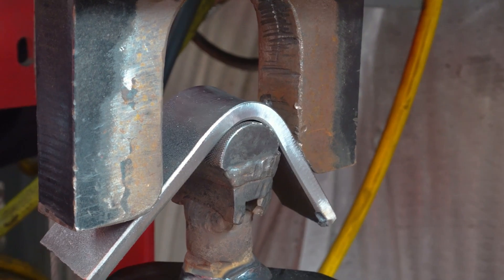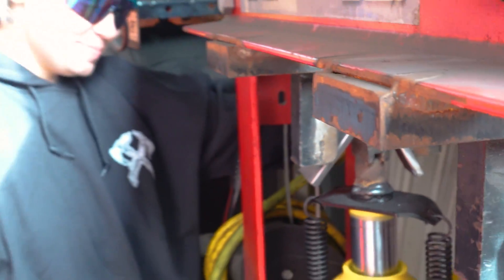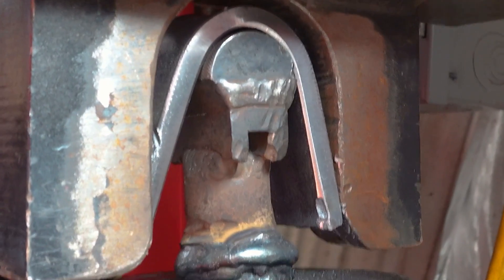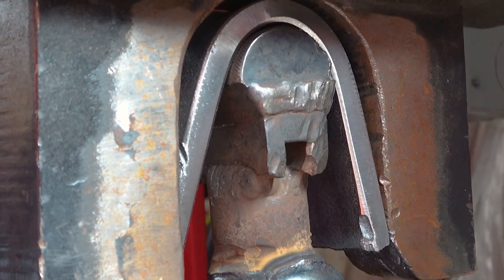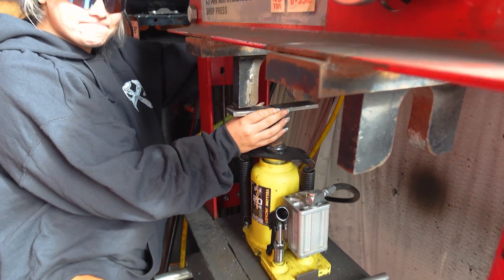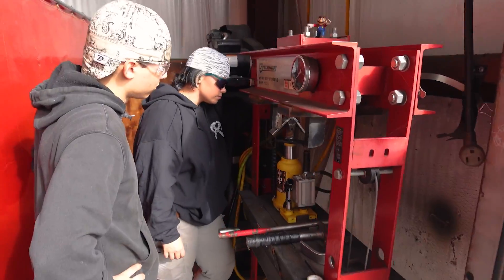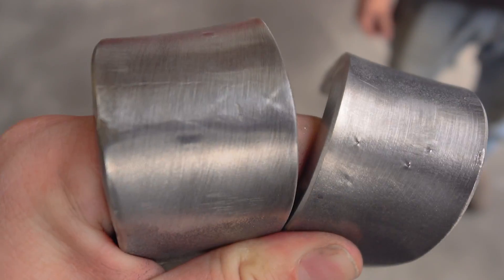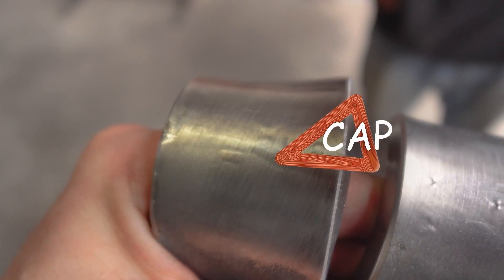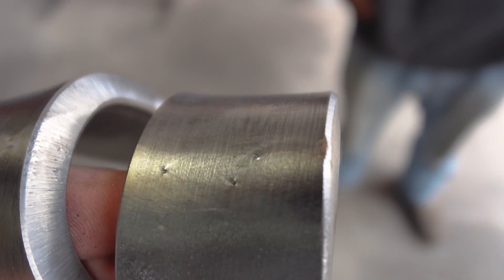The slowest bender ever — we've got to do four of them. So much suspense in that bend. All the way to the tipping top with it. We've got the root bend done — we'll take a peek at that in a second. Let's get the cap. It's a brand new jack too. On the cap on the left you can see a couple little stress marks where something is in there, but it didn't open to the surface, so nothing counts.